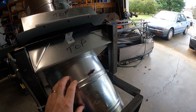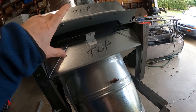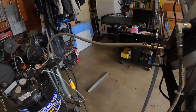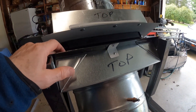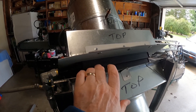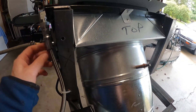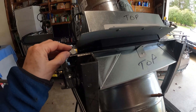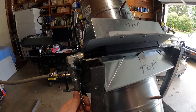We have a fan pushing air through and a fan pulling air out, and these two plenums are pretty much airtight. Both fans come on when the compressor turns on, giving us a very even flow of air across the entire cross-section of the cooler — it's very efficient. We've got the lines tied here so vibrations will not transfer into either the inlet or exhaust, because vibrations will cause them to fail. I'll show a quick video of what happens when that occurs.